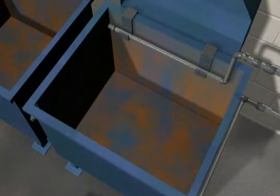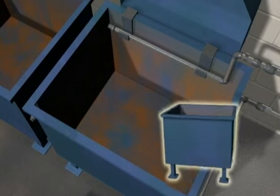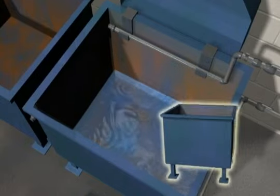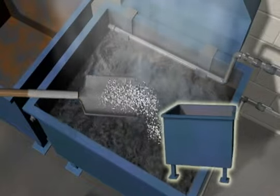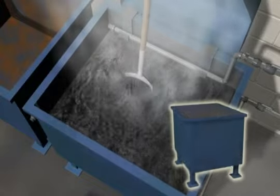The tank shape is important for safety. No matter what size, the shape of the tank should be trough-like or cube-shaped, meaning the depth of the tank is less than the length or width of the tank. This allows good, shallow boiling and additions to mix in efficiently. Chimney-shaped tanks that are tall and narrow tend to layer and boil over very easily.